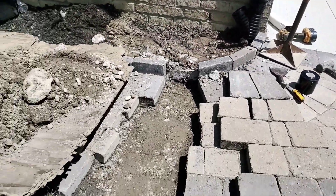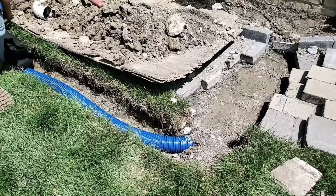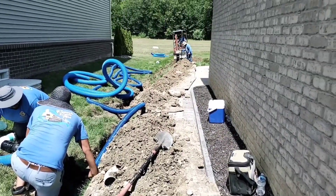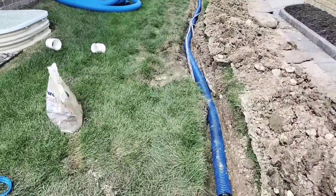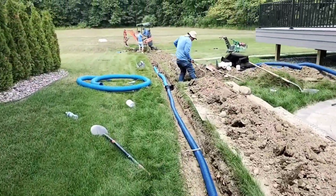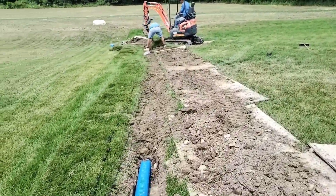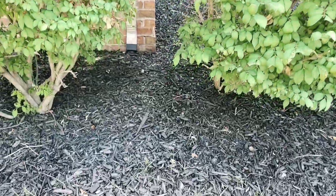You want to get the water far away from your house. How far do you go? We'll pull up a brick paver walkway and relay those pavers to get the water away from the house. In this case, we don't want to let the water go right in between two homes — we want to get it far away from these homes. If I had to give you a number, I would say 15 feet past the corner of the house — front corner or back corner. 15 feet past the corner of your house is where you want to be discharging the water. Minimum.